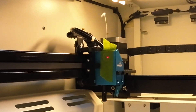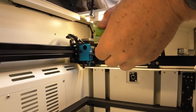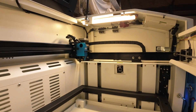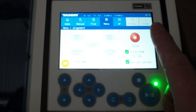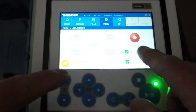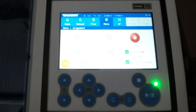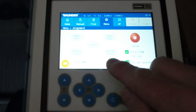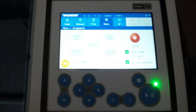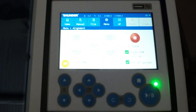A couple of tips: you can leave the red dot pointer on or take it off — it just doesn't show you the red dot. This pulse time is preset, defaulted — in this case it's 70 milliseconds. What I found when I first started to do my alignment is when I kept trying to pulse it, it wasn't burning my masking tape. I started in the bottom right for my first pulse test, and these settings would not burn through the masking tape. So I took it off manually, started turning up the pulse time and the power, and eventually got a hole burned through it. When I clicked on upper left and moved the laser to the top left corner of the honeycomb and pressed it again, the tape caught fire.